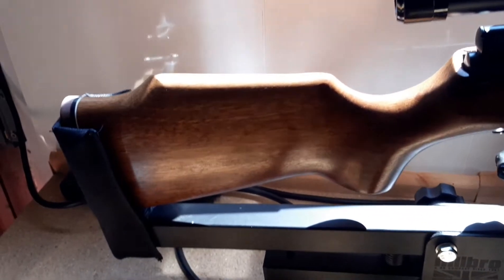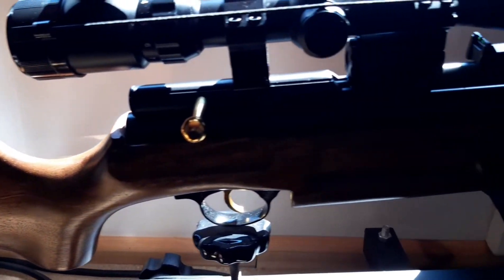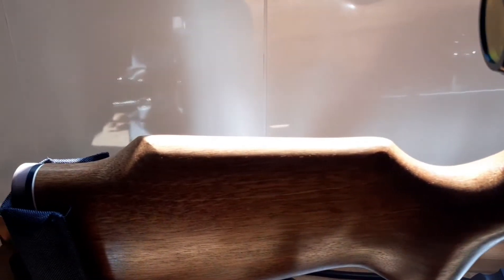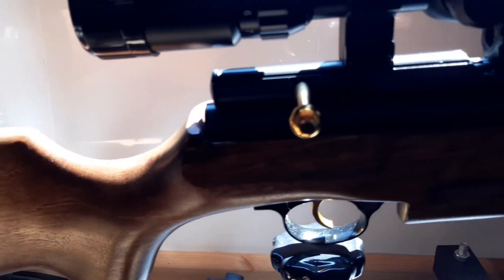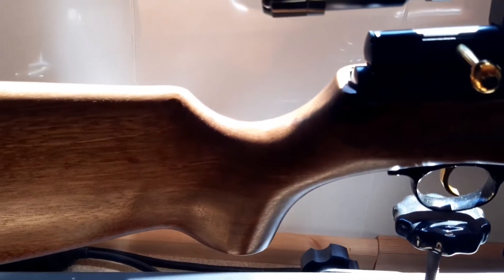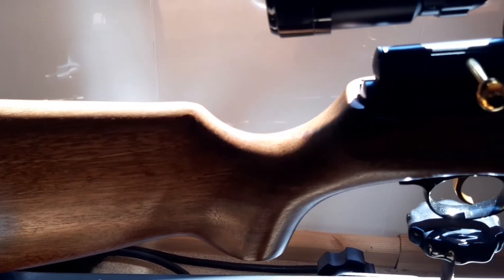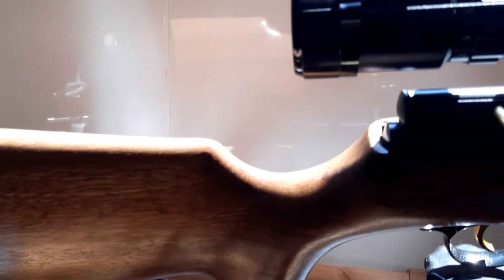As you can see, the oil stock has come up very well — I'm really pleased with that. I'm going to give it a couple of coats of wax just to really waterproof it. I wasn't going to go this shiny to be honest, but once I got going I couldn't stop. I stopped before I got to the piano finish, so it's still a nice sheen without being visible from space.